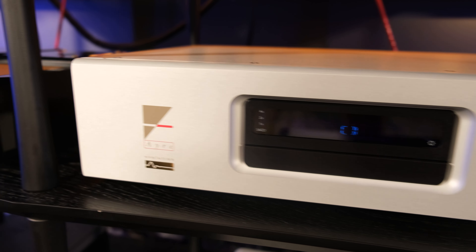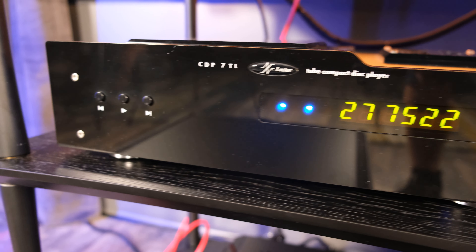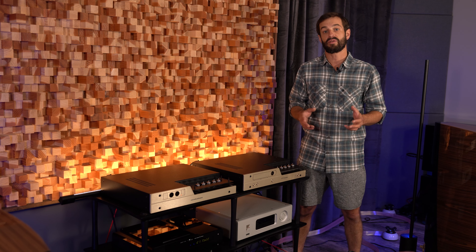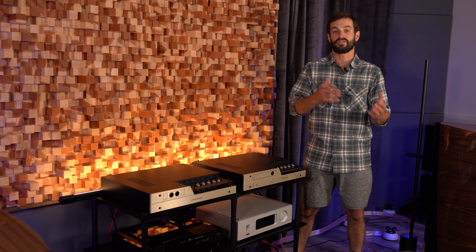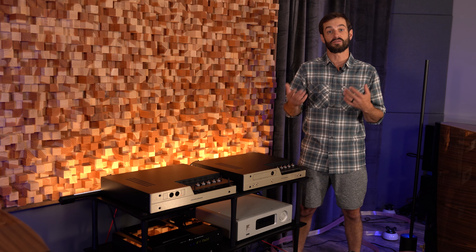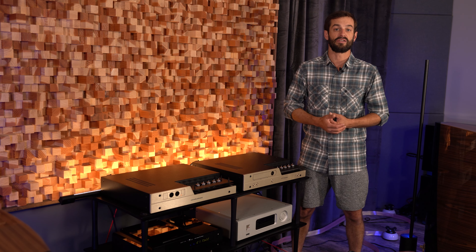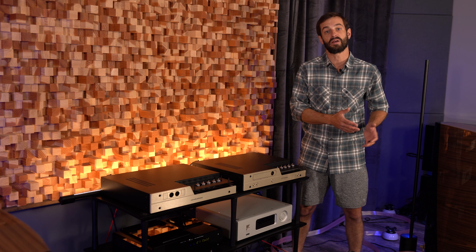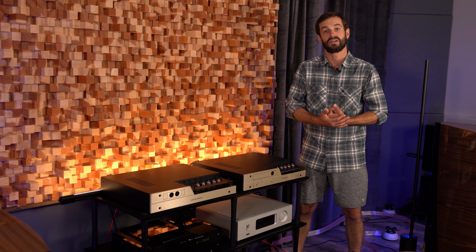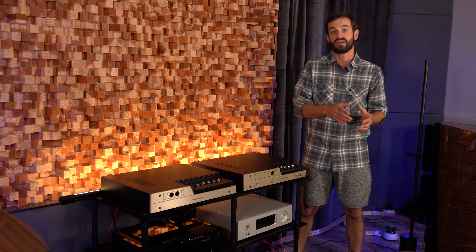This draws a parallel to the entire tubes versus solid state debate. While the tube output of the Lektor is in the small signal range — so the device doesn't exactly mimic all the strengths and weaknesses of a tube amp — it still sheds light on what tubes do best. Because a tube's internal elements are separated by just air, a vacuum, just space — contrasted to solid state devices that are hunks of silicon — the capacitance of a tube is much lower, and on a well-dialed-in system this can absolutely be heard. There's no free lunch in audio: we're often just choosing between two styles of compromises. But there are ways to assign tasks to either solid state or tube devices to make the most of their own electrical strengths, and that pays dividends.